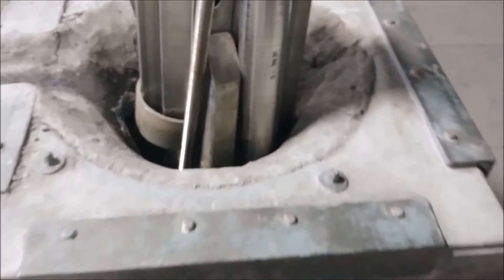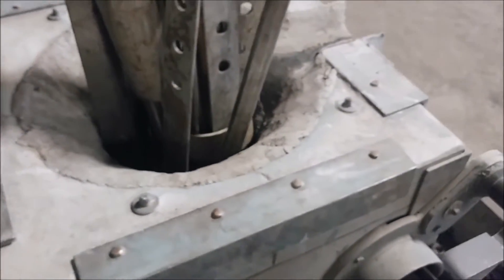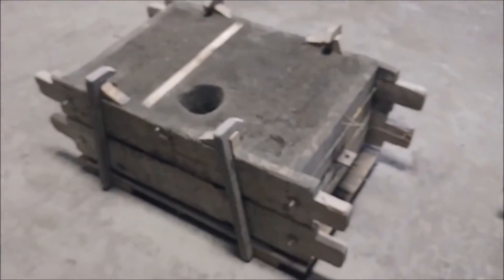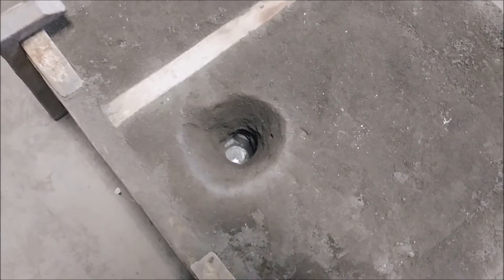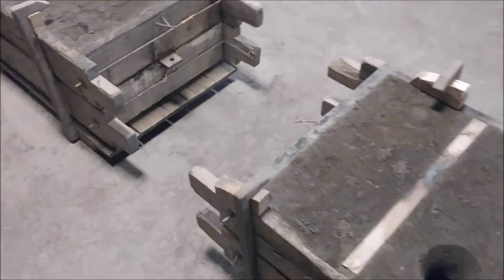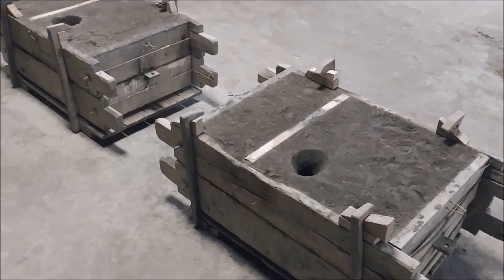This is our induction furnace here. We're loading it up with stainless and it's about a 500-pound pot, so we're going to melt down about 500 pounds at a time. Then we've got two molds over here and we're going to pour the stainless right down there and it'll fill in the mold and create a part. We're going to do these two boxes today, and then the remaining stainless we'll just make ingots out of.